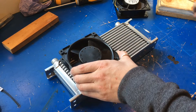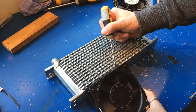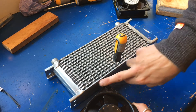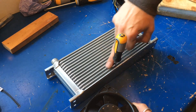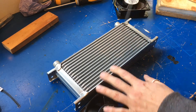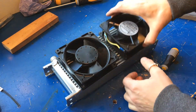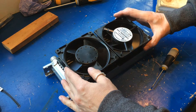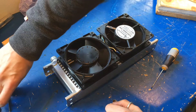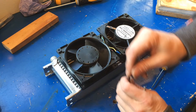This is a little bit cavalier I have to admit — where the other fixing point is, I've pushed a screwdriver through the fins. These are just cooling fins; the oil channels are the larger stripes you see here. I've pushed a screwdriver through in a couple of places so there is enough room for the M3 studding when I get it. For now I'm going to cable tie these in place, wire the fans in between so the electrics are in the middle, and then attach the temperature switch on the hot side wired through to the fan electrics.